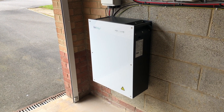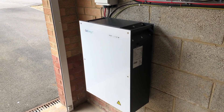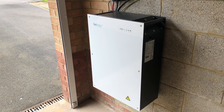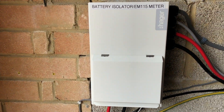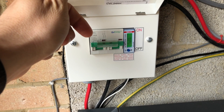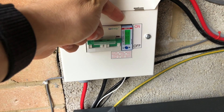Here's the battery. It's an 8.2 kilowatt hour lithium-ion battery with 100% depth of discharge. Behind the scenes it's actually a 10 kilowatt hour battery but with 18% reserved by the battery management system. Just above this battery is the DC breaker which cuts the connection between the battery and the inverter, and next to the breaker is the EM115 which is basically a really fancy CT clamp.